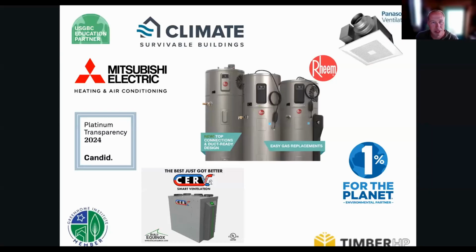By the way, other people have mentioned multifamily. It's important to know that multifamily housing does not have a 100 amp requirement. Instead, it's really whatever the electrical engineer says it is. I've seen as little as 30 amps, which is rare, given to an apartment, and usually 60 amps or 80 amps. What we've found is that you can do an all-electric apartment if you have 60 amps. You have to do all the power efficiency we're talking about in a standard stove. So 60 amps is a bit of a threshold unless you start addressing the stove in the kitchen. That's usually the biggest problem because it requires a 50 amp circuit, and you can't have a service that's the same size or smaller than the largest circuit. So 60 amps is kind of the threshold before you have to think of something more creative about the stove.